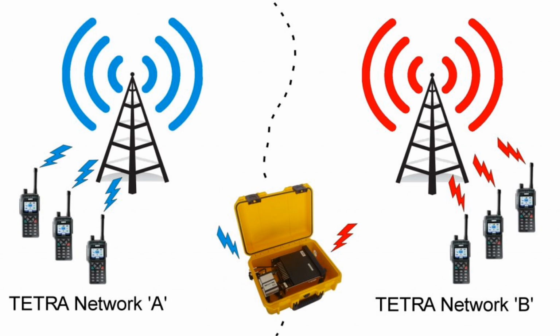And the base radio part. That needs configuration too. Setting unique IDs, IP addresses. Then you run through a whole set of station verification procedures, checking software versions and, really critically, verifying the transmitter and receiver performance. Measuring things like bit error rate, BER, and received signal strength, RSSI, making sure the signals are clean and strong. It sounds incredibly thorough.